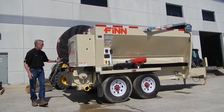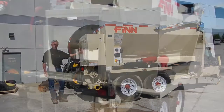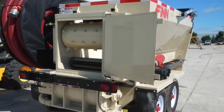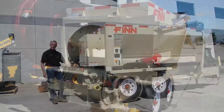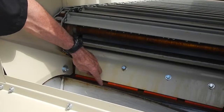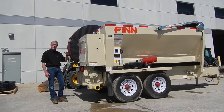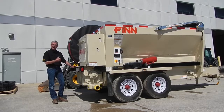Inside the back is where the actual airlock is located — where the material feed goes in and discharges out through that area. Below there's a knife that must be maintained and kept sharp. It shears the material as product enters so it doesn't prematurely wear out the airlock.